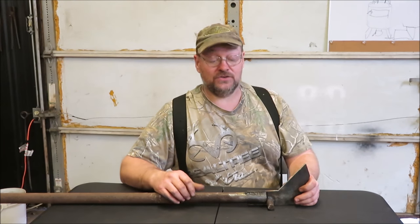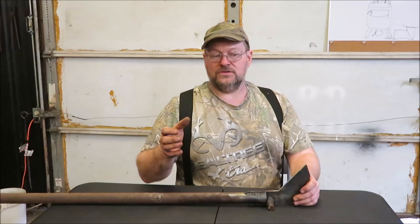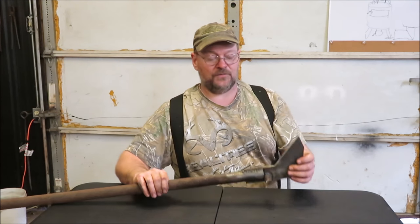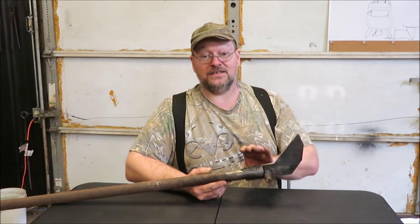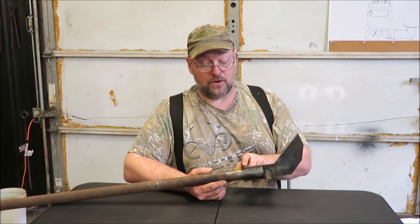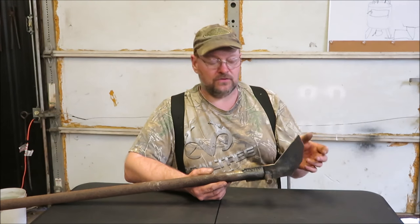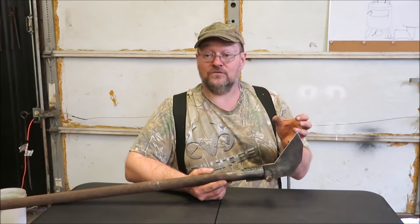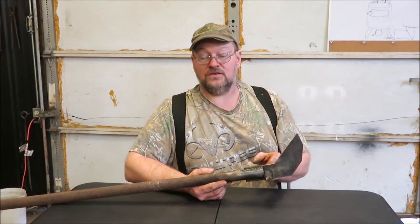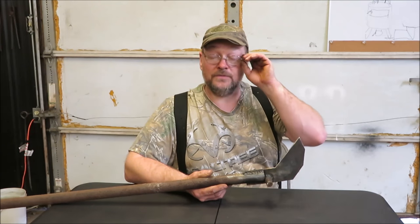The pallet bar was definitely a lot easier to build than the last one. The last one had a lot of welding and it had trouble fitting anything bigger than a two-by-four, but with this one I can just run it on the side of the board, which helps a lot with this pin going across. This is much easier to build — just about anybody could do it. All you need is a four-inch grinder with a cutoff wheel and grinding wheel, a welder, and a drill. I was going to use a seven-eighths dowel but couldn't find my bit, so I ended up with a three-quarter inch dowel and it works just fine. I hope you guys enjoyed the video — don't forget to subscribe, leave a thumbs up, thumbs down, or comment. Till next time.